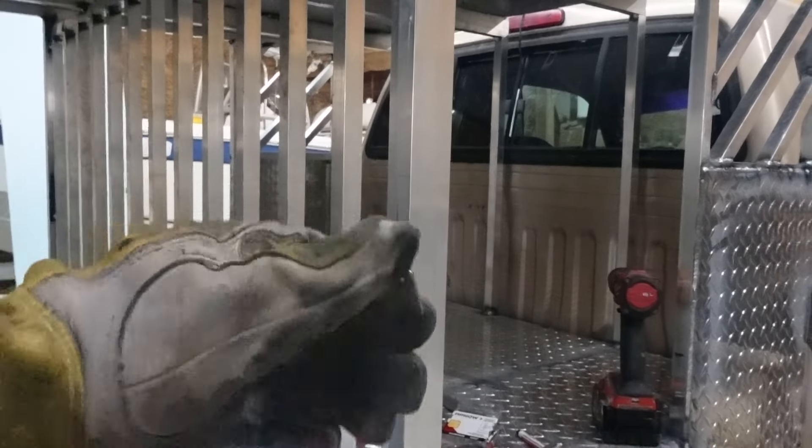Boom, nice. Now we're going to put these railings on here and match them up just right with the rest of it so it looks like a continual run of one-inch tubing. It's also going to make the door strong. Get all the doors done just like that. The only thing we've got left to do is to slide this bed back — it's kind of heavy, but we've got it slid back. We're sliding this back piece in place. Tack that top corner, got it where it goes, tack the bottom — that'll hold it. Then I just run my bead all the way down, go to the other side, do the same thing, and weld a few in the middle.